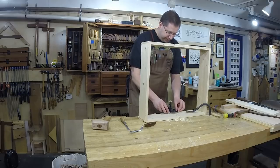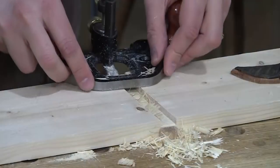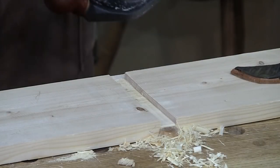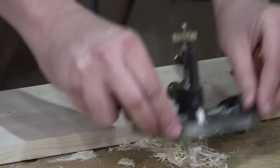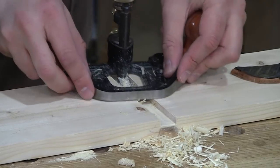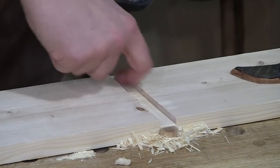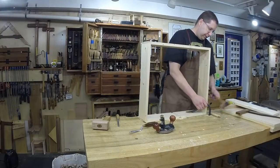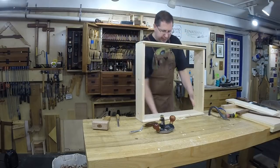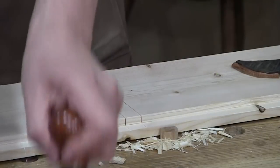As long as you're not taking super deep cuts with your router plane, the light cut will cause the fibers to shear off right at that knife line. This saves you from constantly flipping the case around and worrying about spelching. With this particular case I could just turn the whole thing around and work from the front to the back — that's probably preferable since the material's already been removed at the rabbet so it's not going to blow out. But I wanted to show how that wooden bench dog trick helps, because sometimes you need show sides on both faces and need a clean exit to the dado.